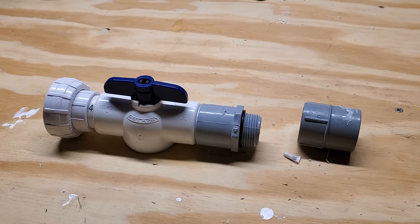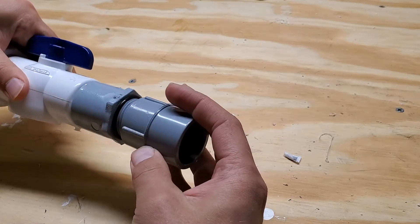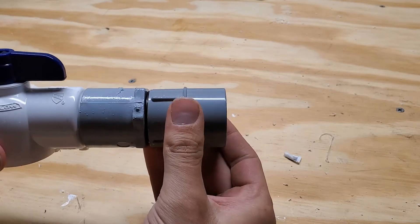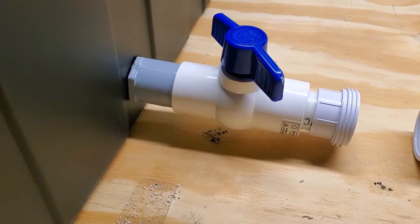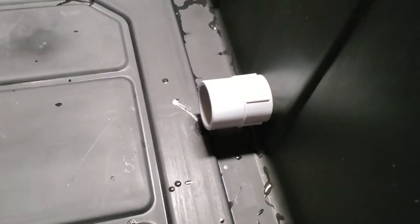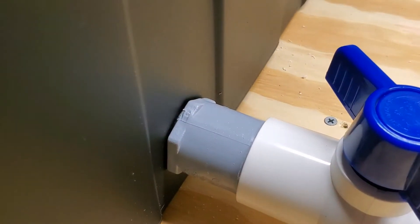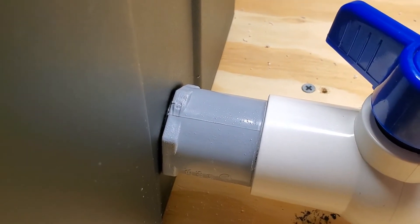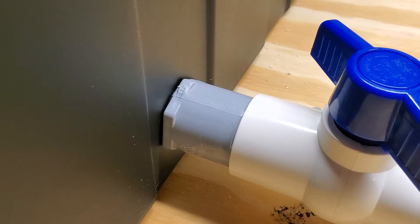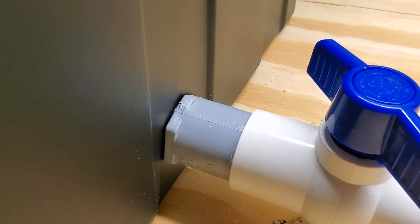The union allows you to screw this side to the other side. The reason I use the conduit fittings is because they don't have tapered threads, so that allows you to screw them all the way together without the threads starting to tighten up — so we can tighten it as tight as we want onto the wall of the tank and really seal it up. Here you can see the assembly actually attached to the reservoir. On the inside you have the female conduit fitting screwed down to really tighten it against the wall. The o-ring is on the outside and seals this from any water coming through the threads. This was a one-and-a-quarter inch hole, which is pretty tight for this thread, but you can screw it in and it's just big enough to fit the conduit fitting through it.